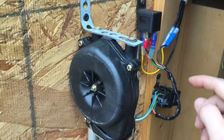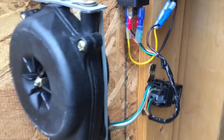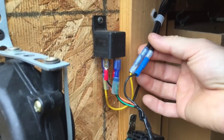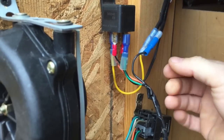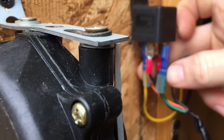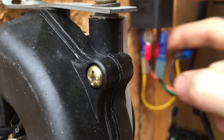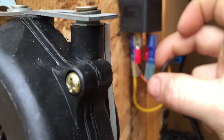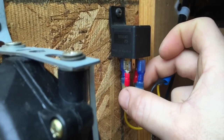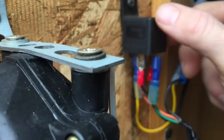The second wire here is connected to the landscaping lights, and that powers a relay that in turn shuts this door. If you're wondering how I wired it: positive and negative from your batteries — your 12-volt source — run to your relay. You've got a magnetic actuator on the relay that closes the contacts, so you wire power to your motor and to one side of the relay, and ground to the motor. Then from your landscaping lights or your timer, run positive and negative to the magnetic side of the relay.